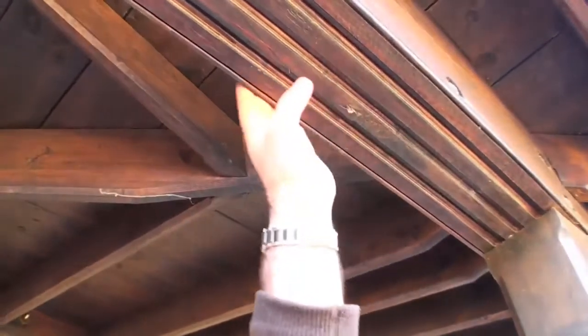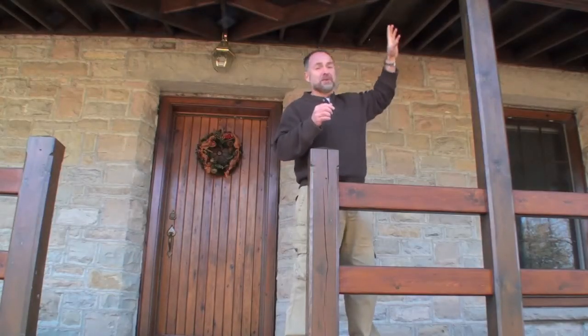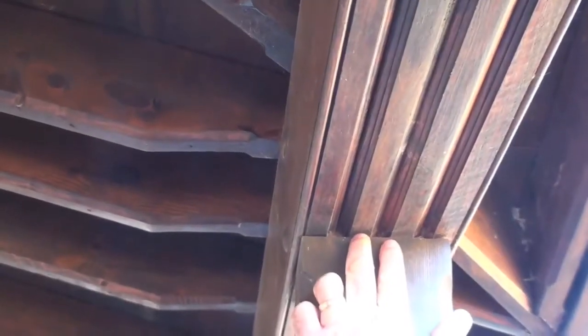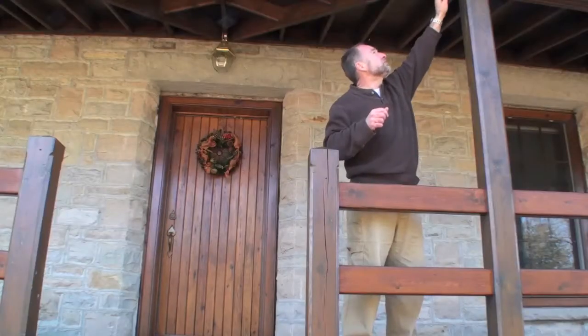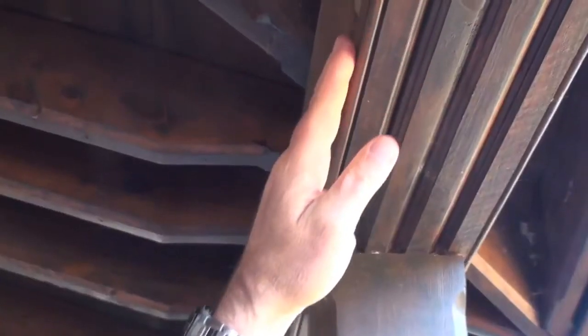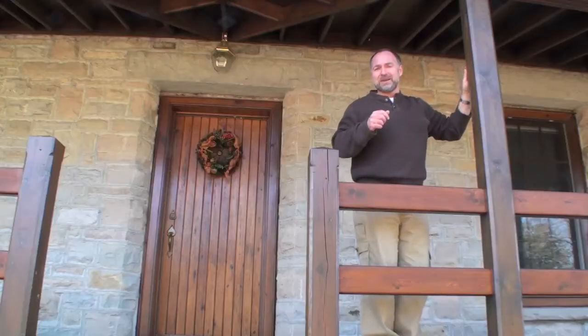They're four 2x8s, bolted together. The reason I did that was because it was very easy for me to create the necessary mortises in that structure for the tenons that I made in the tops of the posts to fit in with them. You see, these two pieces of 2x8 here stop where it meets the tenon and the post, while these outer ones extend past the post and rest on a shoulder that I've cut at the bottom of the tenons on the top of the posts.